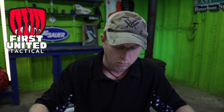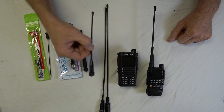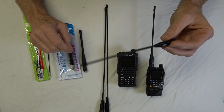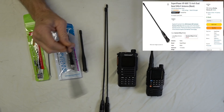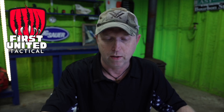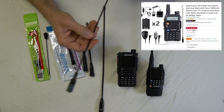We also did the normal Ocean stock antenna and a little bit of the Expert Power. I just wanted to try it out again in an area where it wasn't working as well last week, and it didn't work out well this time either. I'm actually going to put it on the meter and start chopping it down to try to get it closer to 465 MHz — we'll find out in another video. Also the Nagoya 771G, the all-time favorite, all-time king if you ask me. And then the generic Baofeng extended range, which really, really shocked me this week.